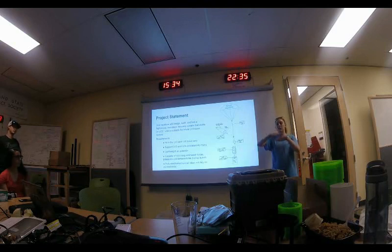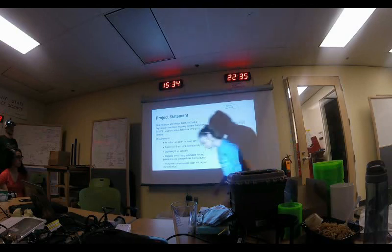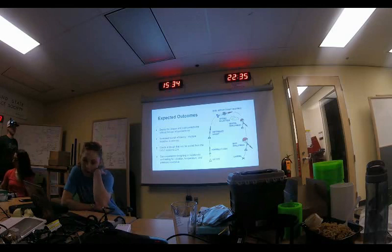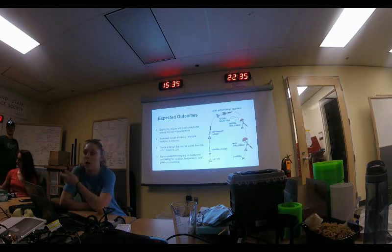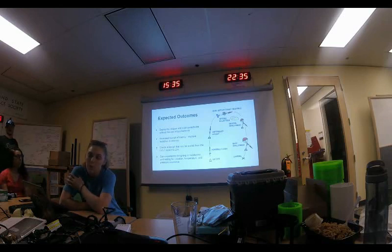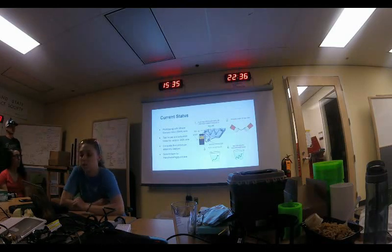The goal is to keep the main cup as close to the body of the rocket as possible, because if there's too much distance, air can catch underneath and rip open the cup, deploying the parachute early. Our expected outcomes were to deploy the drogue and main parachutes without pyrotechnics. The main goal was for LV 3.1, with future intent that this is a scalable design for LV4 — nothing about it is limited by weight or size.